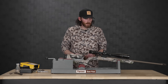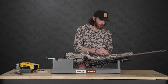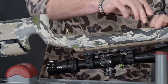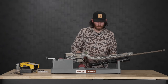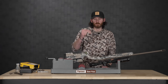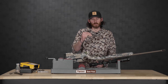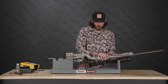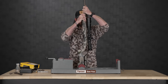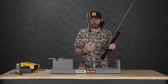To do this, obviously make sure everything is safe and unloaded. I flip the gun over, take an Allen wrench, loosen this up, take the floor plate off, pop both of those out, and then this piece comes off. Take those out — if you're unsure which goes where, take a picture now. Usually the short one is in the front and the tall one is in the back. Now I have to carefully pop this stock off, which can sometimes be a little difficult because it is factory bedded. You can see the factory bedding up on the front and on the rear.